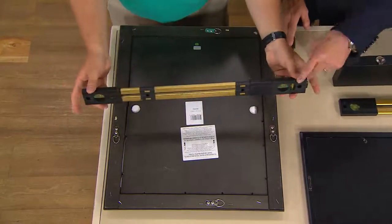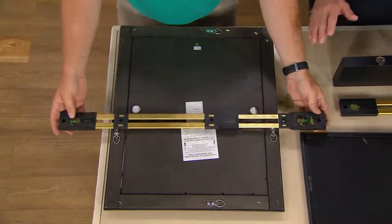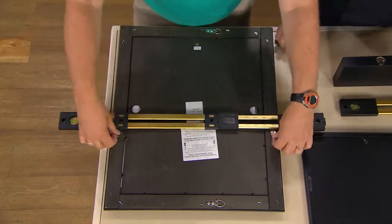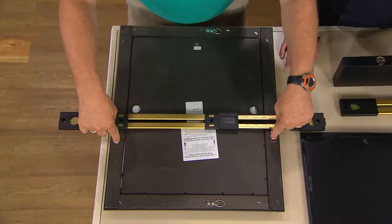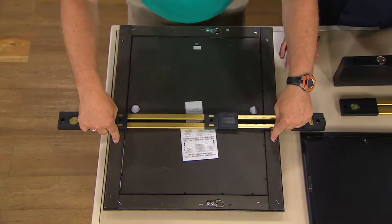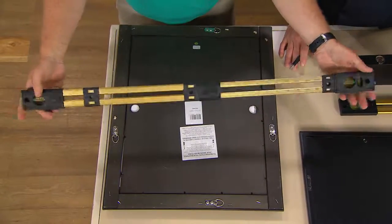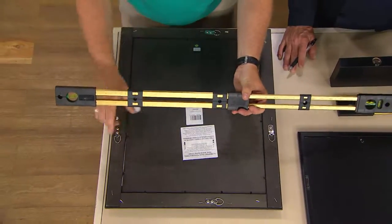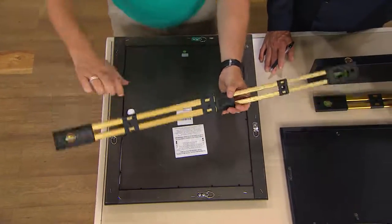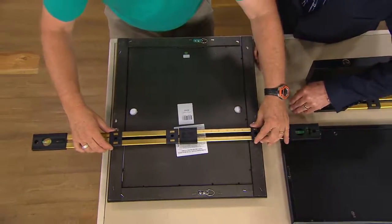This is 36 inches, it's got bubble levels — three of them — and a bubble level will never ever lie to you. Here are the D-rings; this is where we have to put the screws in so these hooks can hook onto the wall and the mirror is straight and level. All I did was take this and slide it out — it goes from two feet to three feet. There are slides, and I don't even have to measure. I just put one right in the center and one here.